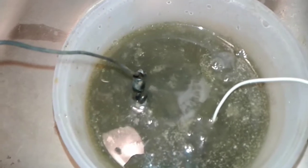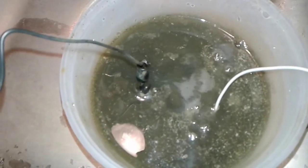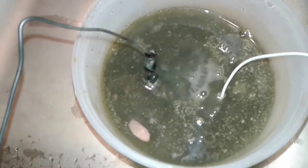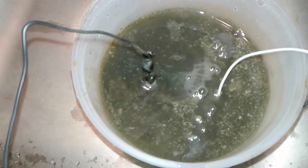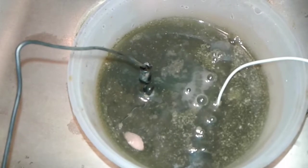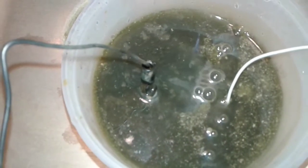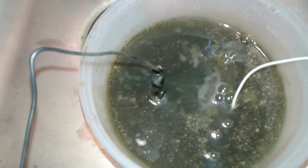I'm just using a lawn mower tractor battery. The white is the positive — you put your sacrifice iron onto that. The black lead is your negative — you put your relic on that. It flows negative to positive, and all that bad metal junk goes into the sacrifice iron. So make sure your negative is on the relic and your positive is on the sacrifice iron.